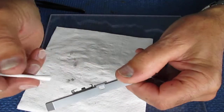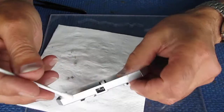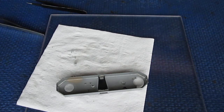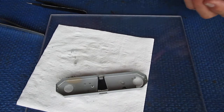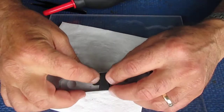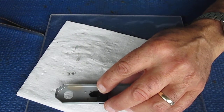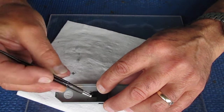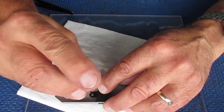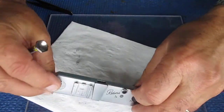Make sure that the glass surfaces are clean, particularly the inside ones, because we're not going to get to them very shortly. I'm just making sure there's nothing in there causing any issue. Any dust — you can brush that out. This just pops down into place and fits over the other piece. That black piece — a screw holds this in position. And that's it, that's the viewfinder cleaned, nice and sparkly. The top cover can go back on the camera.